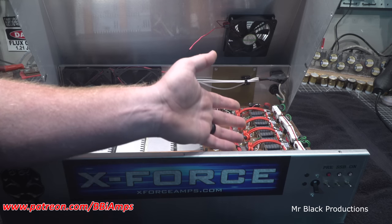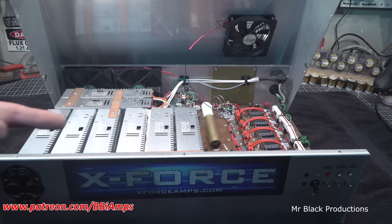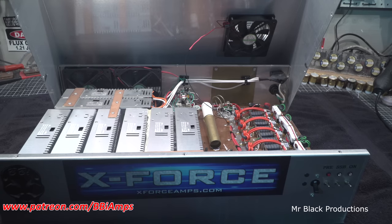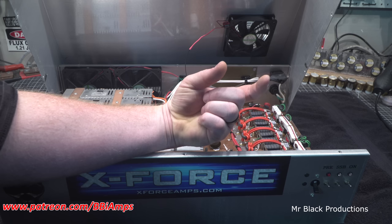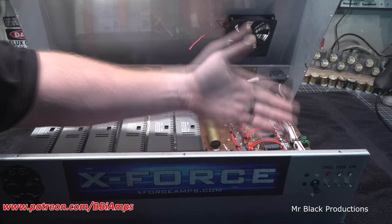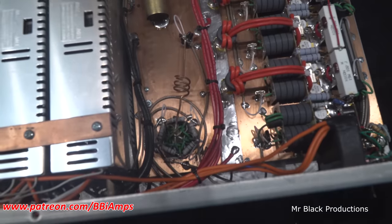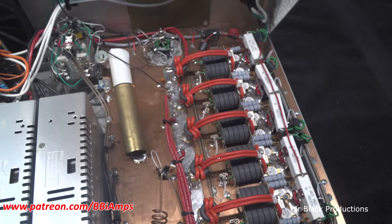And then in the bottom side of this thing, it's just a horrible design. The slot that's in the back was too small, which on this one we had to open up. And if I'm not mistaken, I think this is the one where the heat sink for all 12 of the transistors was only this wide. And we replaced it with a full-size heat sink. So the airflow has to wrap around a bunch of stuff here in the front of the cabinet to exhaust its way through the heat sink.